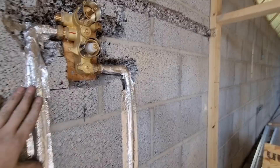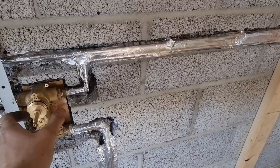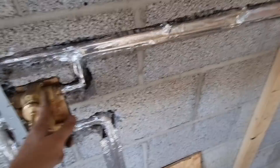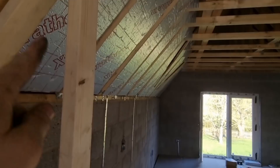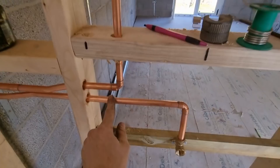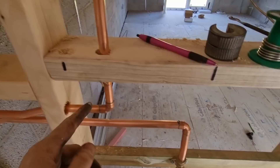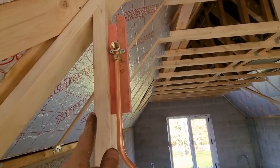I'll get this dropped in and get them put in - hopefully the phone won't ring for a few minutes so I can get this done. I'm just setting these wall plates up. I've double checked with the face plate for the shower to make sure it doesn't specify which is the fixed head - there's no drawing, no markings on the chrome plate. Sometimes it will show a rainfall head and then a hose, but on this one it doesn't matter. So I'm just going to take that one to the top and that one to the bottom. These are dead square and solid - that is the centre of my shower, that's halfway across so everything should line up. These are all in and set now. I just dented my pipe a little bit when I drilled through for that one, so I just need to cut that bit out and replace it, but other than that everything should be set up. It's a 900 tray so it just comes out with the arm.